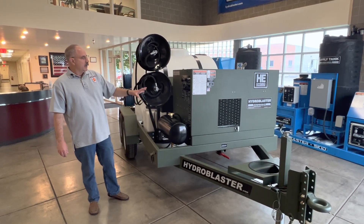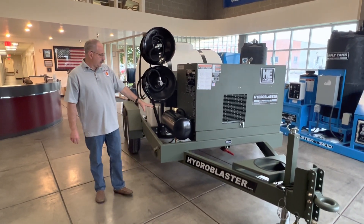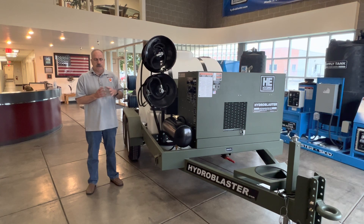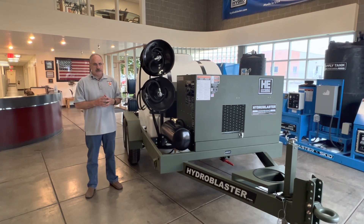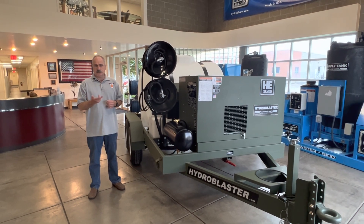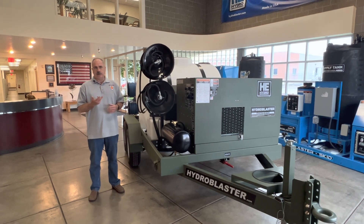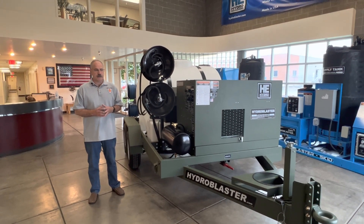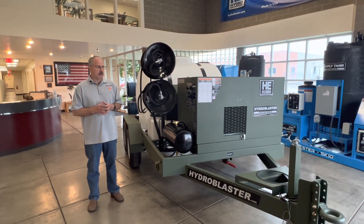This side of the aircraft wash system is for the external wash. You have your control panel, your receiver tank, and your two hose reels that will rinse the soapy water off the aircraft. This system conforms to the Tri-Service Manual, Air Force Manual 1-1-691, as well as NAVAIR 509-2, which restricts the pressures allowable on the aircraft surface to 175 PSI. This system is set not to exceed that, and is also set to conform to temperatures not to exceed 140 degrees Fahrenheit onto the aircraft.